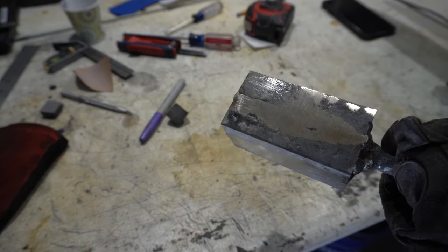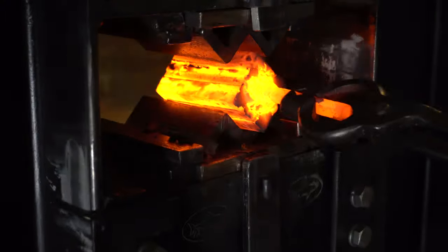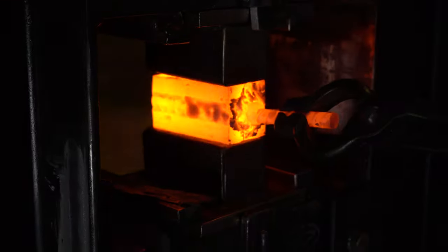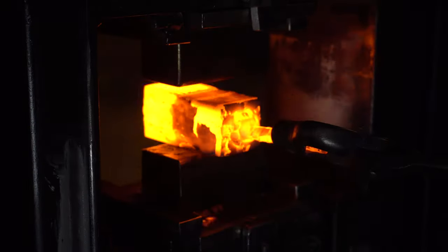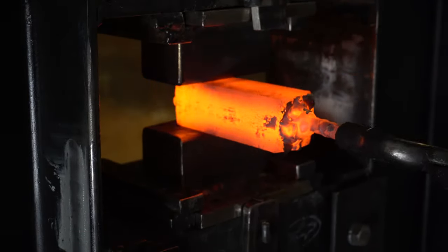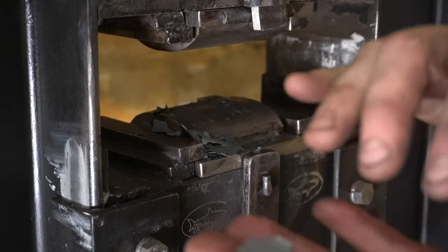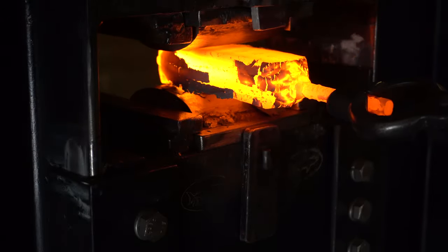Here's the trick I learned. After I did the MIG weld, I went to the grinder and ground down the MIG weld so there's just a really thin layer over top of the seams — but that's enough to keep the air out and that's all I need. All the scale coming off while forging on the press likely took off the remaining MIG weld, but if it didn't, it certainly came off when I ground the next step.